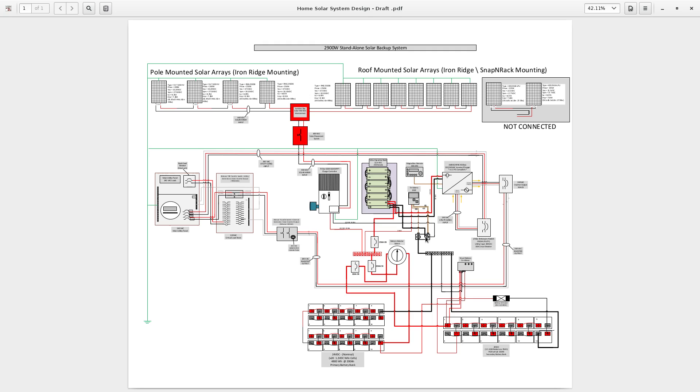Power from the charge controller connects to the positive bus bar. The power first goes to my ultra capacitor bank and then to my batteries. My ultra capacitors are connected from their positive and negative terminals to the positive bus bar through a 250-amp circuit breaker and to the right side of the shunt. When inverting, you'll see the amperage on the Trimetric slowly decrease; when charging, it slowly increases.